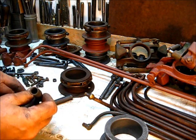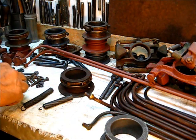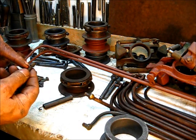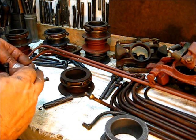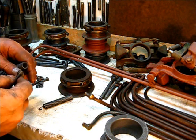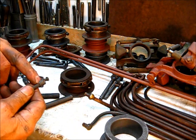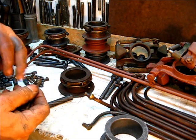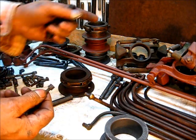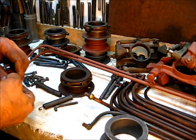Another thing — the inserts in these springs. See, this one doesn't have one in it, and right here they are — that's the little insert that's in that spring right there. The thread on this insert is the same shape and thread count as this spring. So you do have to grind yourself a special bit to thread these if you're making them. These are pretty easy to make — grind yourself a tool bit that is the same half-shape as the spring inside, then thread the inside quarter-twenty. Left hand and right hand — don't forget that.